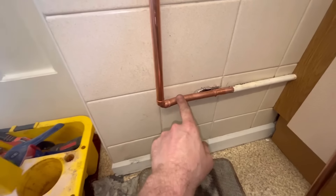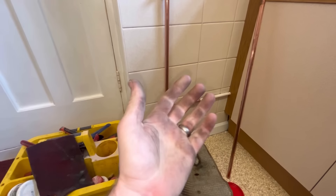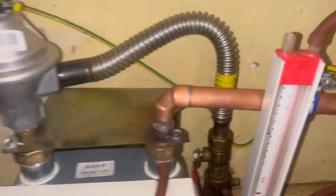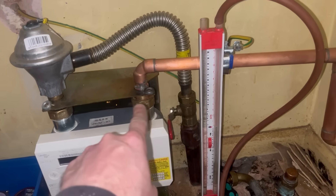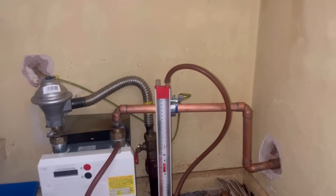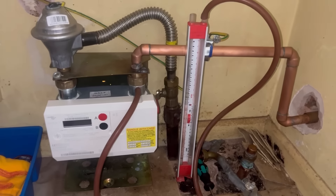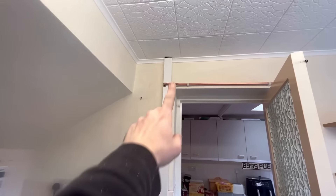There you go - better working environment. Clips in the wall, piping done - put a bit of a bend on that just to kick it off the wall, couple of elbows, straight up, another elbow on there - that's it, very neat, all done. Let me just wipe my dirty hands on that. So on to the gas meter - we're going to re-pipe a section of that. We've finished up on the gas meter, just got the tightness test on at the moment. New bit of pipe, new meter connection straight across, bump straight into there, new earth clamp on there. That's got rid of that lead pipe - tidied the upper bit in there.